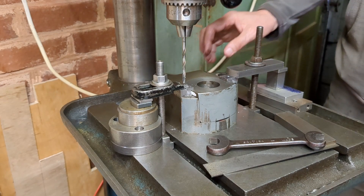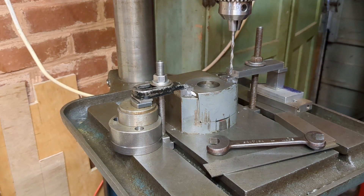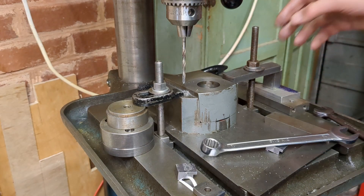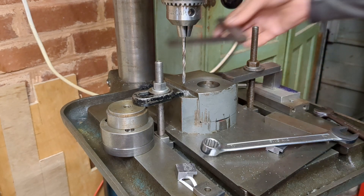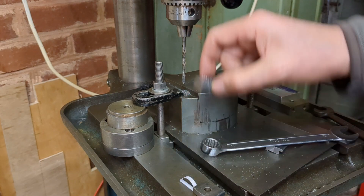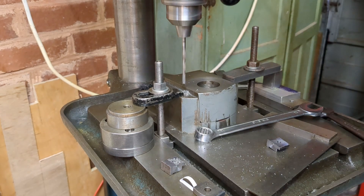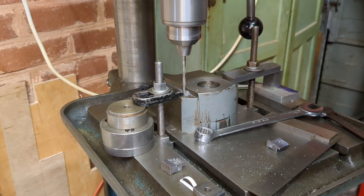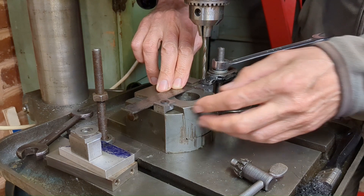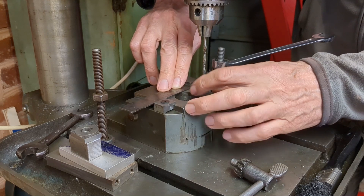What we're going to have to do now is rotate the head, and that's going to require some further adjustment. There's a lot of fiddling around trying to attach my square to this. I think the easiest way is just to tap this one, clamp it in position, and then match the other one to suit. So I'm going to drill this to depth, then tap it, and move on to the next one. That certainly makes getting the second clamp in line with the first much easier.